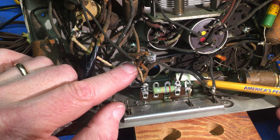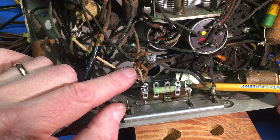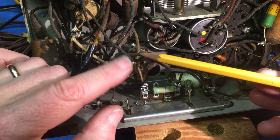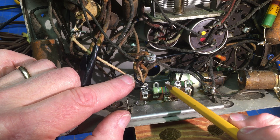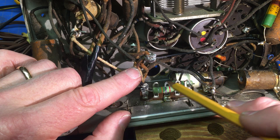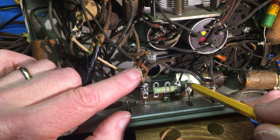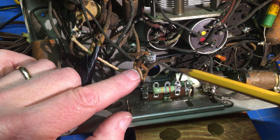I could come to here — it's the same as here — but this block isn't going to be big enough. So what I'm going to do is take these and put them on this spare terminal — not the ground, the other one — put a jumper from here to here, and then put these two back on. That way I can distribute it between those two terminals.